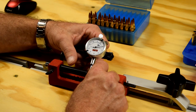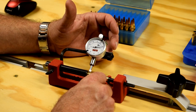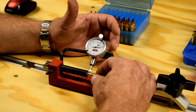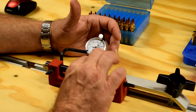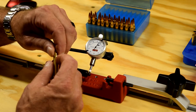So let's stick another case in here and see if we can get something on it. I threw my zero off and I'm not all the way there. Now I'm all the way up on the pilot. It's reading about just over 92 thousandths. So let's rotate that around — up to about 93, 92, 93, 94, 90. So I've got from 90 to 94 — plus or minus two thousandths on that one on the concentricity.